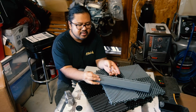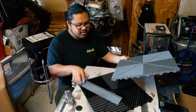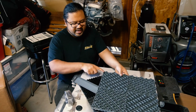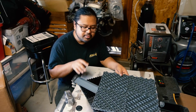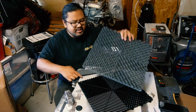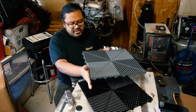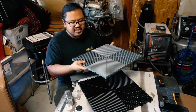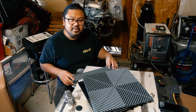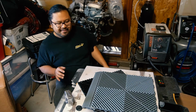These are the loop pieces, so that's why they have the loop. And to make these mate, you find an edge which is like a surface edge, but below that edge there's tabs, and then those fit in the loops. Now, this edge trim piece also comes in the tab version, which is the opposite side, because with these Swisstrax tiles, they come in the loop side on these 2 edges that are joined together, and then opposite of those edges are the flat side or the tab side. So it just depends on your take on how you want to set up. Let me get this fitted, and then I'll start making a row all the way to the back. All right.